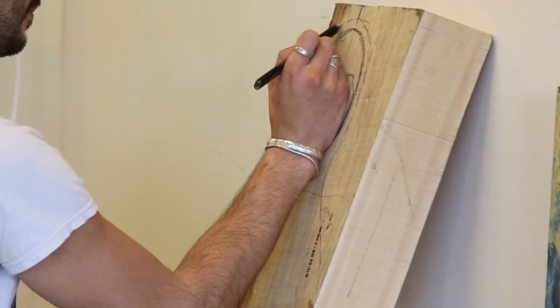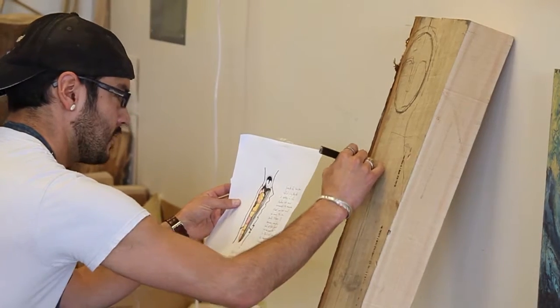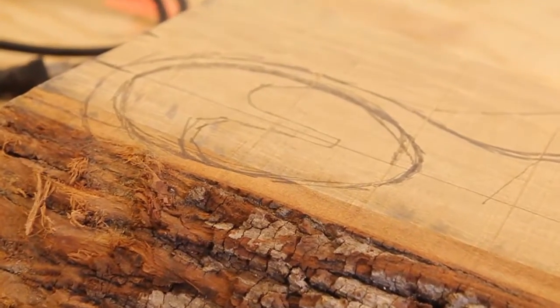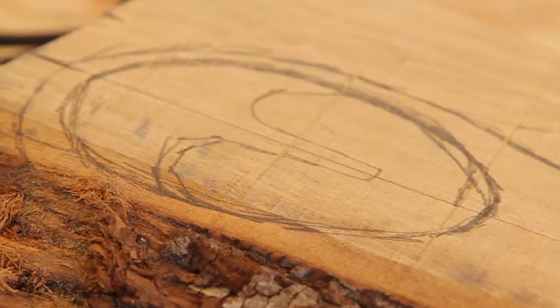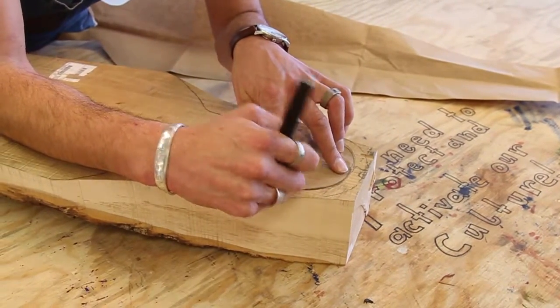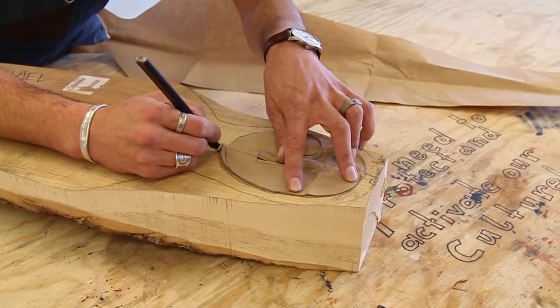Most of the time when I'm starting a piece, I spend some time meditating or calming myself and thinking about where a story lives within myself and my body. And then before I create a piece, I imagine that process and what the formation of that piece will look like, what materials I'm going to use, and even think about the different steps, like what areas I'm going to cut out first. If I'm going to take a block of wood and make an outline of a shape, what areas I'm going to cut out quickly, and then what areas I'm going to spend more time on making more detailed cuts and shaping.